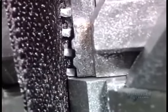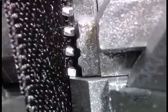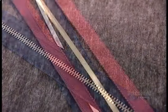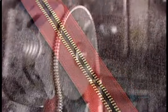As we see here in slow motion, the machine cuts off a tiny piece of flat wire, forces it through a die that forms it into a tooth shape, then clamps it onto the edge of one side of the tape. The machine does all this at a rate of 45 teeth per second. These zipper teeth are aluminum; sturdier zippers are made of stronger metals such as brass and nickel. Depending on the model, teeth can range in width from about three to ten millimeters — the wider the teeth, the thicker they have to be.